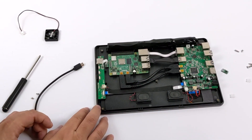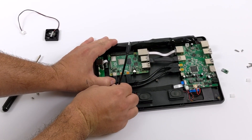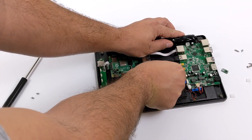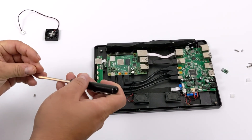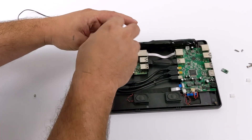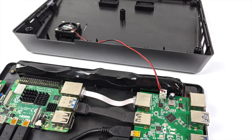I just need to get power to the Raspberry Pi using the USB Type-C cable. One end goes into the USB Type-C port on the Pi, the other into the main board — this feeds battery power to the Pi and external power when plugged into a power source. That was pretty easy — we're basically all set up. I just need to put in the extra screws for the Raspberry Pi 4 and add the included fan, because these Pi 4s get really hot and this is in an enclosed space. I've installed the heat sinks: one for the CPU, one for the RAM module, and one for the USB Type-C module.